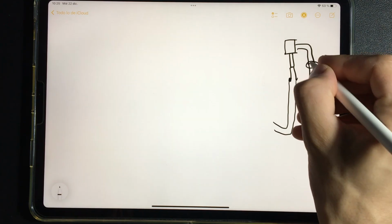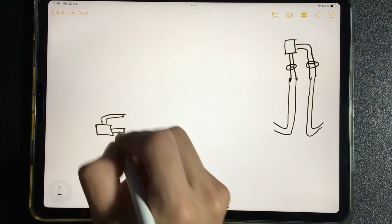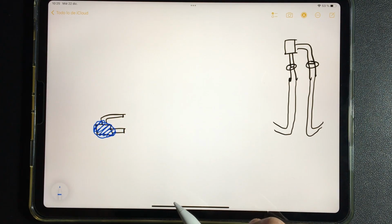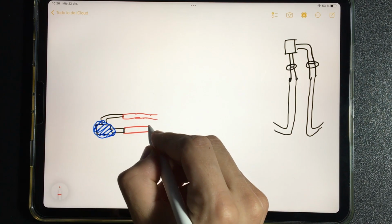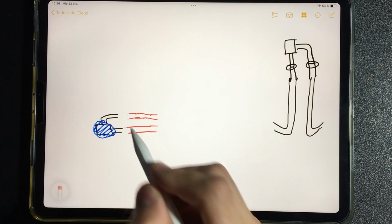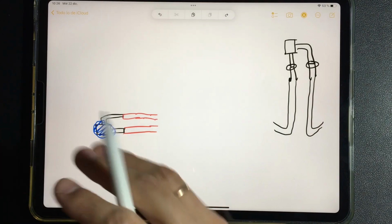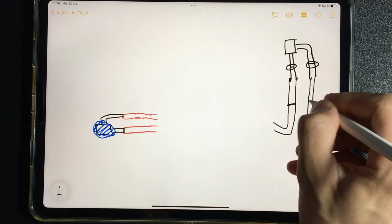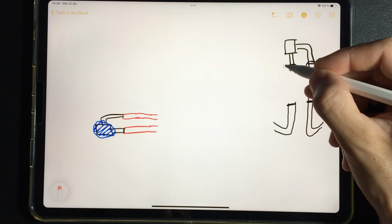What can you do instead of soldering at these points? Well, when you buy the expansion valve, you can place it on its side where you can wrap it better with a cloth with water, and solder some longer pipe sections, and leave your expansion valve with longer pipe sections. So, what will you achieve? Well, when you are going to place it in the equipment, the welding you will do on the equipment will already be much lower, because you will cut the pipes here, because your expansion valve already has longer sections in place.